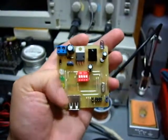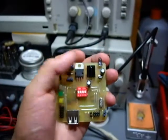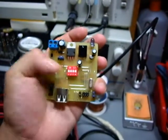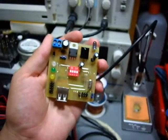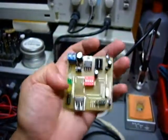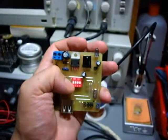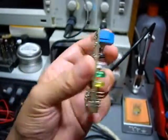That's for stabilizing the voltage. Here you can select the voltage source — like if you want to have a supply voltage over USB, or if you want to use this voltage regulator here. This is the programming connector, the ISP connector, and here you can connect the target supply voltage. Overall you have three ways to connect power to the board. This is the connector to the UART. You can set up your address later on.